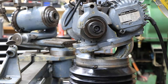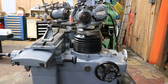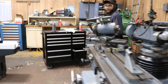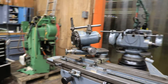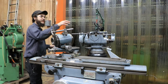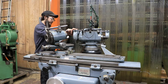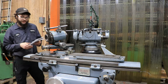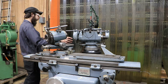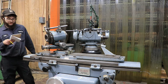This does come with a manual lube pump that you do have to fill up from time to time, but it does the job. The spindle does have three different speeds depending on what size wheel you put on it. The speeds are 2600, 3700, or 5200 RPMs. With the wheel that it has on right now, it is set for 3700 RPMs.